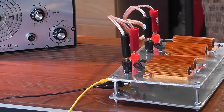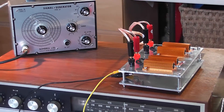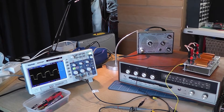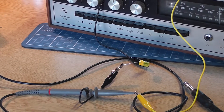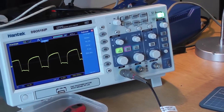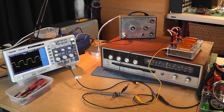So here we have the speakers disconnected, and the dummy load connected across the speaker — the audio output, 4 ohm outputs on the amplifier. I've got a signal generator going in, it's on full whack, and the volume is up full on the amplifier. The signal generator is connected across there. Obviously, don't forget to isolate your scope because of earth loops — you don't want to damage anything or blow anything up. So I've just got a 0.01 capacitor in the earth loop. That's causing the scope display to be slightly distorted, but this is only a demonstration — I'm not really doing any accurate measurements here.